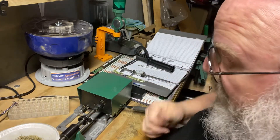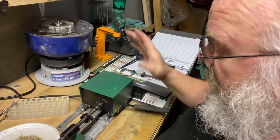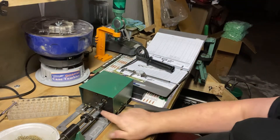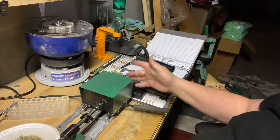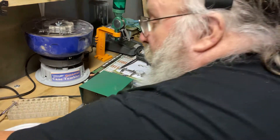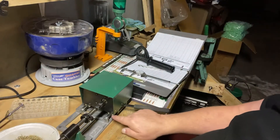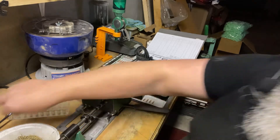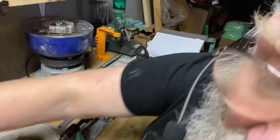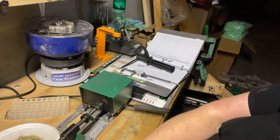This unit is all afloat right now. There's a white bushing on each one of those posts, front and rear — so there's four. When you adjust this trimmer and go right up to it, you run out of trim space because these bushings run right up against the stops. So you're not getting an accurate, consistent trim.